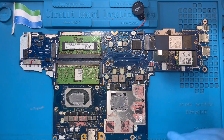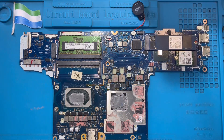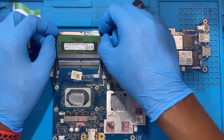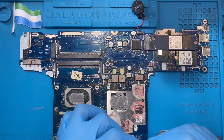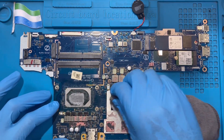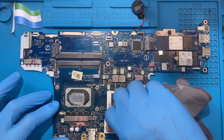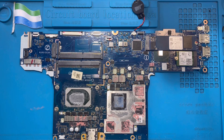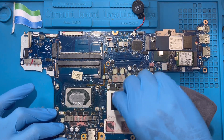Take out the RAM first — this one, remove it. Remove this RAM. Then you clean this oil — the processor paste — it's become like water, which is not good. This can also make the laptop unable to display. You have to remove it and put a new one, but you need to work on the graphic card first before you apply new thermal paste.